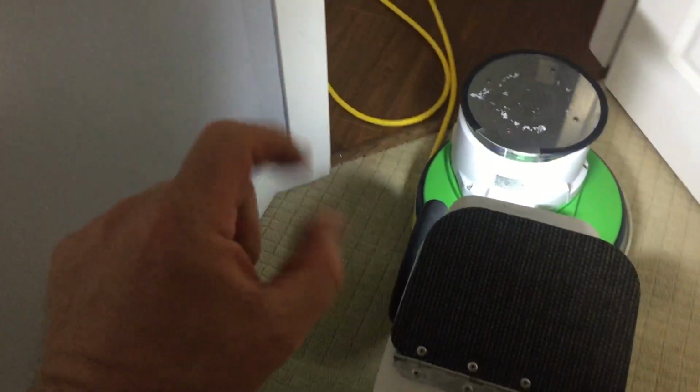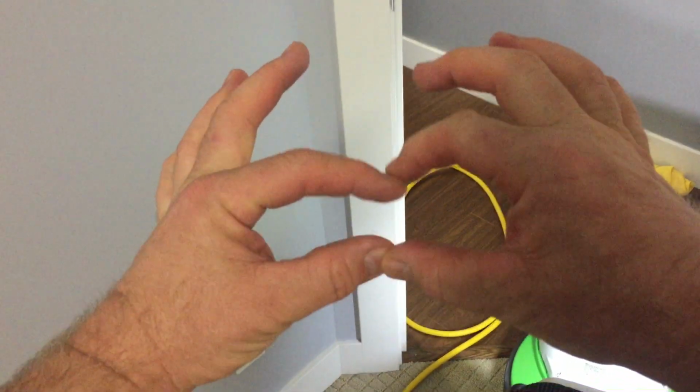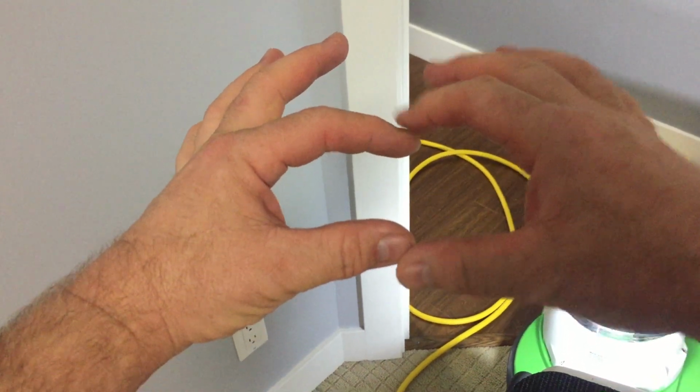Between the two pinchers, there's a spring pushing them apart. And when the handle, which is a pin going down the middle, pushes on it, it sort of pushes the two tensioners, and then they release over on the other side, sort of opens them up, as it were. It's a very intriguing design. Made in Switzerland, actually, this machine. It's like the BMW of rotaries, except it's not as finicky or expensive to repair.